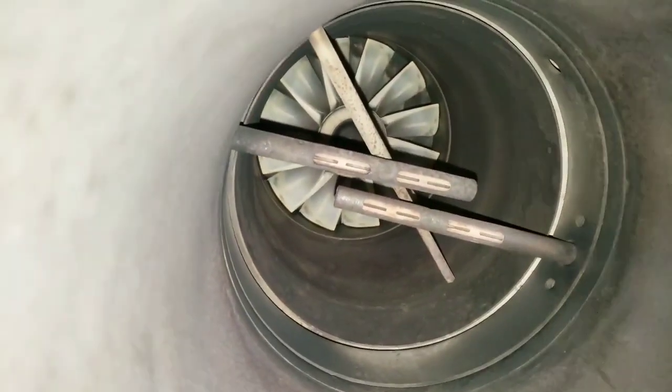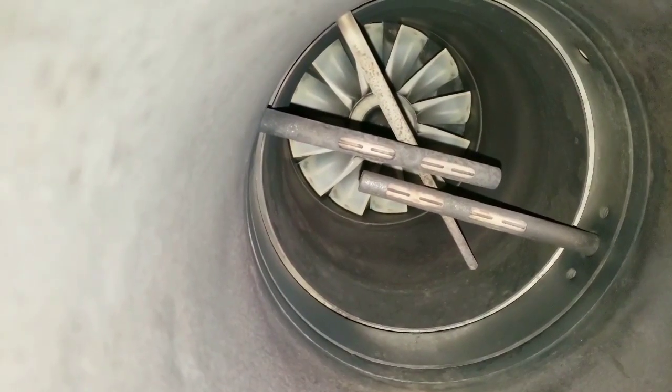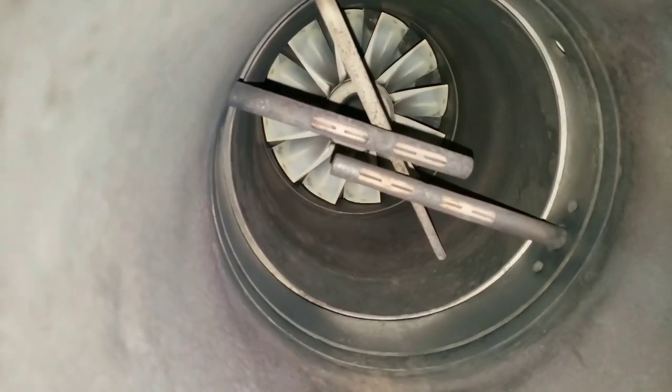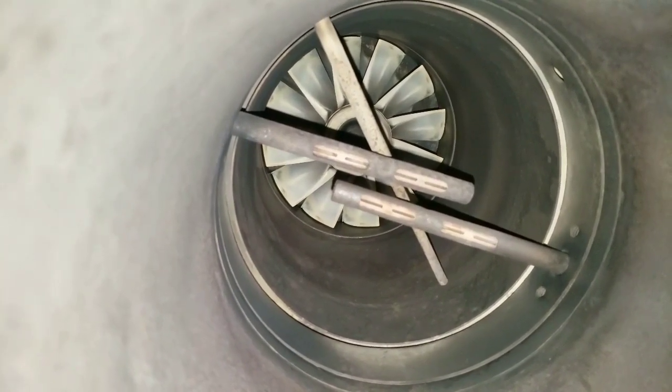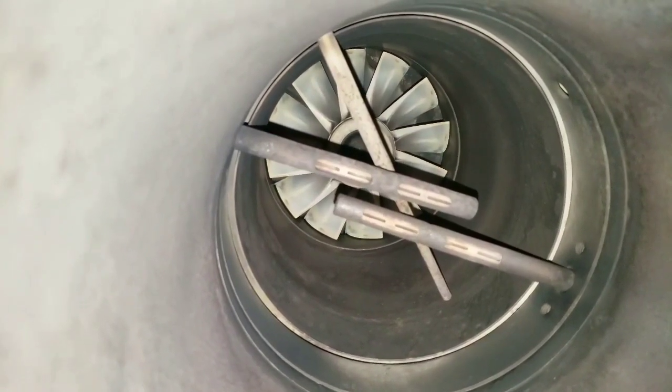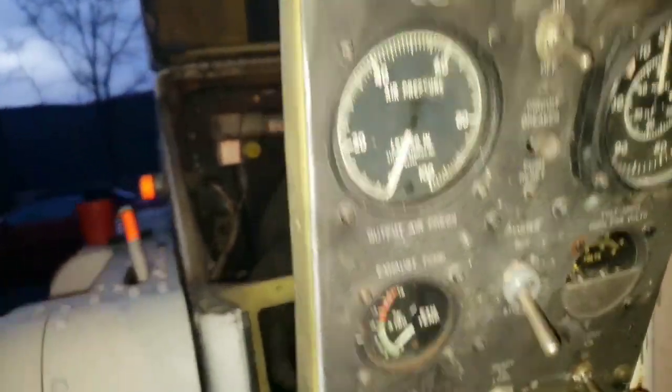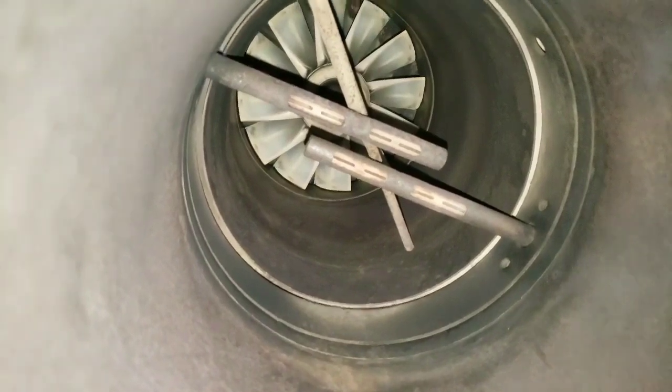Take a look at the turbine section — go down the exhaust, hopefully my phone doesn't melt because I just ran it. There's a turbine down there. It's a lot like a turbocharger — it's a centrifugal turbine, and it's just the one turbine that spins those two compressor wheels. It looks like there are two EGT sensors. One of those sensors goes to the temperature gauge on the panel; I assume the other is probably an over-temp emergency shutoff sensor. I wish I had the manual — I could answer that question better, but I don't.